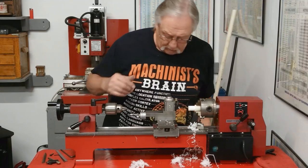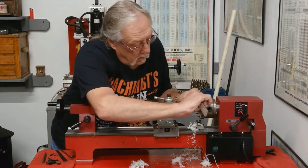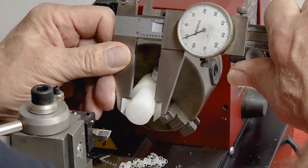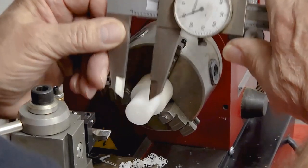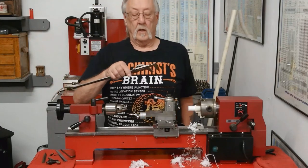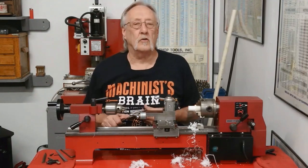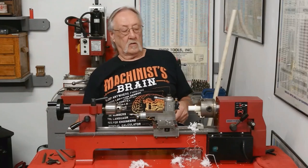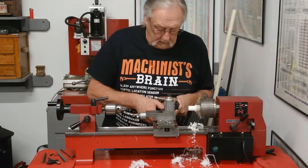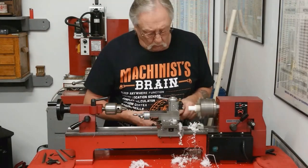Okay, let's measure it and see where we're at. That's 790, and I wanted to be between 5/8 and 750. So let's say I'm just going to take 100 thousandths more and call it good. Ten, 20, 30, 40, 50, 100 thousandths.